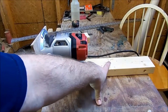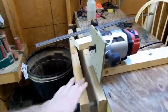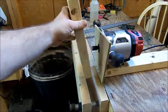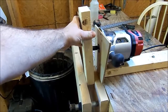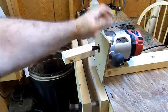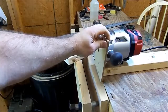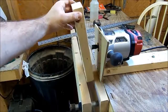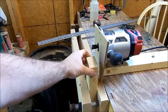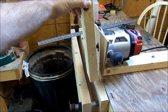I'm on my workbench and I drilled a quarter inch hole in it. I've got a clamp here and I'm going to clamp my radius block into it. My router is set up so this thing is bolted in and swings on the pivot. I can center this thing up, slide it up and down inside my clamp, make a pass, move it up, make a pass, move it up, make a pass — until I get the radius routed the whole way through.